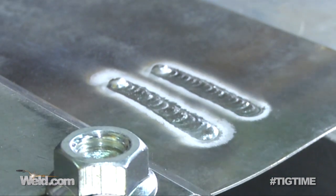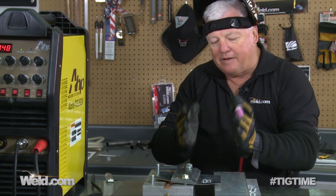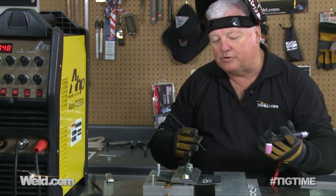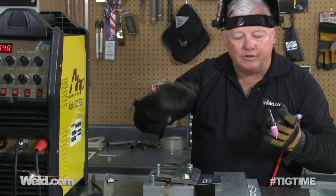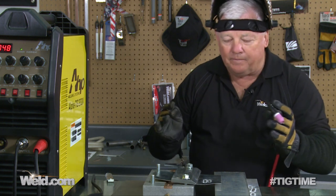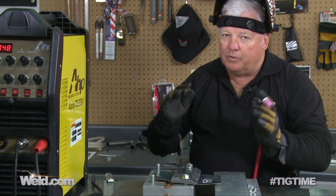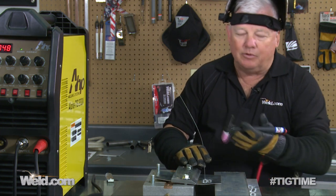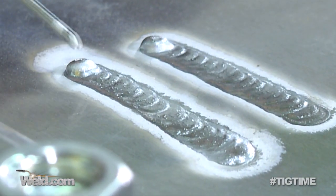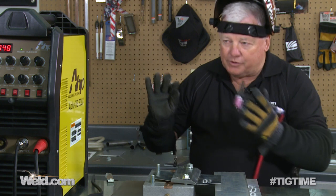You can see a big difference just from a slight adjustment of the cleaning knob. This is pretty thin material, so it's easy to penetrate — not necessarily easy to weld, it'll try to distort on you. But at least the machine allows you to initiate the arc without blowing a hole. It allows you to get to the end of your weld, add a little extra filler, and then pull out slowly with your foot control so you don't leave a crater crack. It really is critical being able to taper off. So it's doing the job.